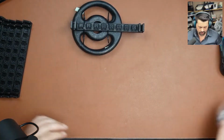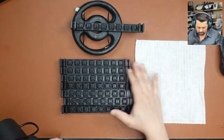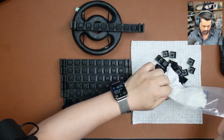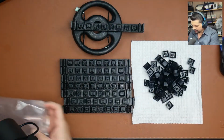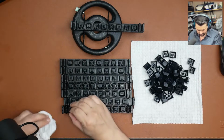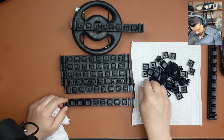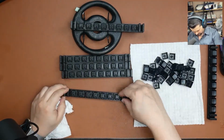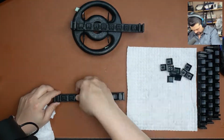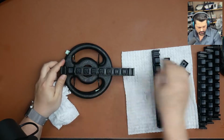So once you have all the switches added, we're going to add some keycaps to the switches. And in this case, I'm going to be using some blank DSA keycaps. I'm going to leave the link in the description for where I got those. They are very, very cheap. And the reason I have them like that is because I use lube on them, so they are a little bit dirty, if you will. So we need to go ahead and add keycaps for all the switches. And finally, we add the keycaps to this last rail here.